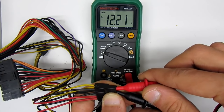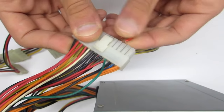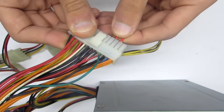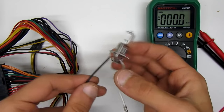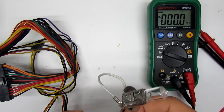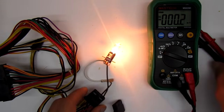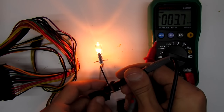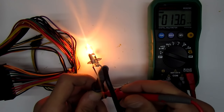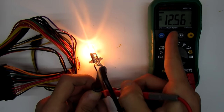How to improve the power supply voltage without its reconstruction? First, we should short the green and black wires. This allows running the power supply without connecting to a computer. The unit has a feedback and PWM stabilization. If loading one of the low-voltage buses, for example the 5-volt bus, we get a voltage drawdown on it. The pulse width modulator automatically tries to raise the voltage to 5 volts, and simultaneously the voltage rises on the rest of the buses. The more the low-voltage bus is loaded, the higher the voltage rises on the 12-volt bus. But don't abuse this, otherwise the unit will be damaged.